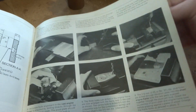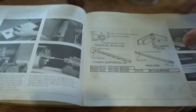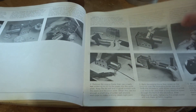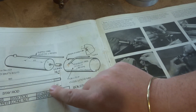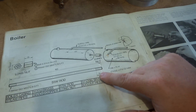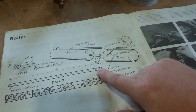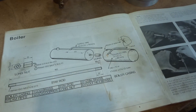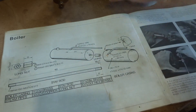I've got most of the materials — there's a few things we don't have yet, mostly bits of sheet, but we'll turn them up. Looking at the traction engine boiler, it's got a stay rod in it, which isn't a bad idea — that's just 3/16 brass, though 3/16 copper would probably be better, so we might do that. It's got a long nut to clamp it to the firebox.